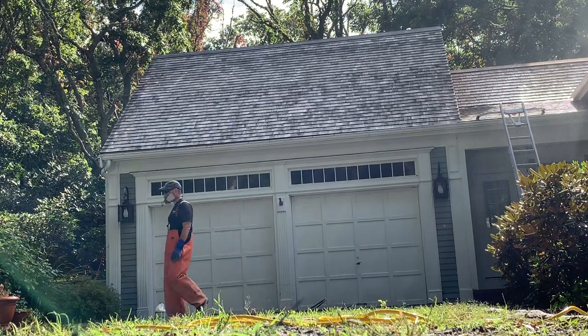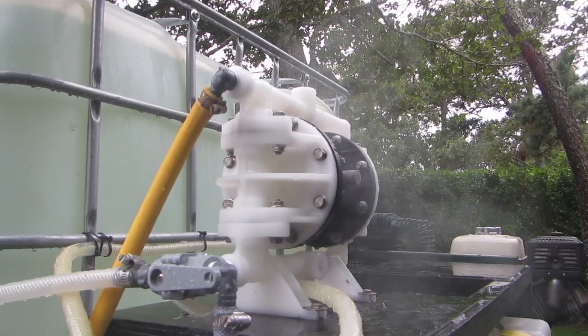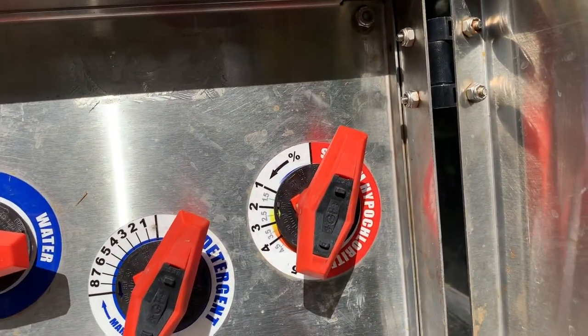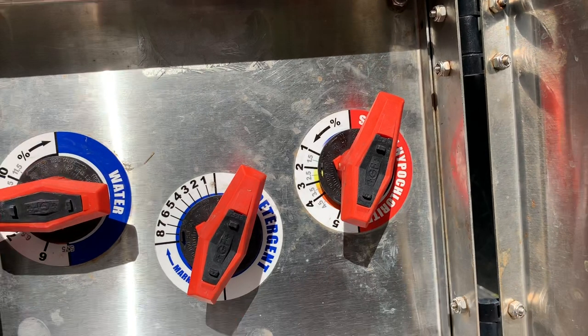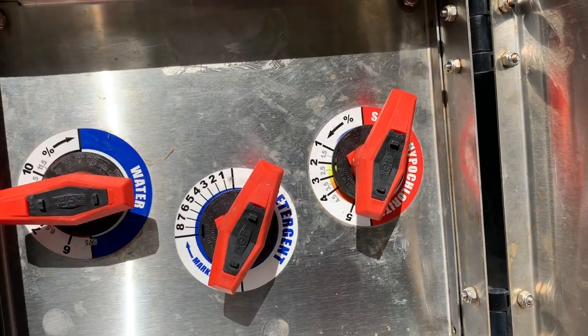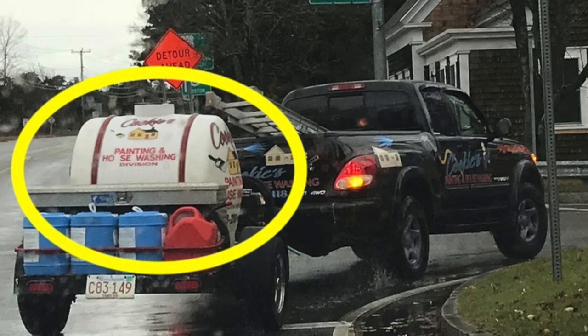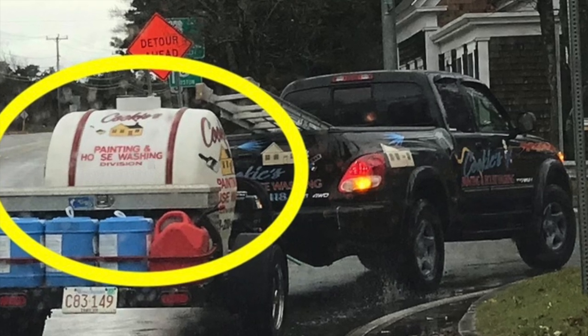Start with a mild solution of chlorine bleach. On my system here, I am pumping through an air diaphragm pump and a proportioning valve. If you're not familiar with those, I'll link to them in the description of this video. I'm starting out at a very light mix, around 1% sodium hypochlorite. And because I've got exterior cleaning soap on hand, I'm going to put some of that in as well. If you don't have a proportioning valve, you're going to have to draw off a bulk tank. If you don't know how to do the math for mixing a bulk tank, there are apps and webpages that can help you with that.